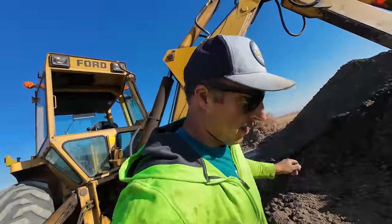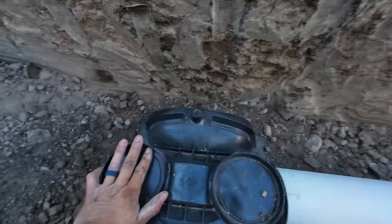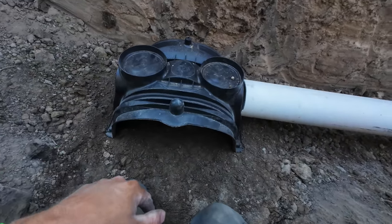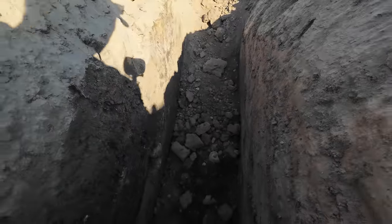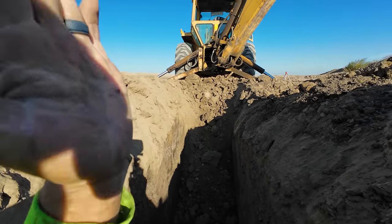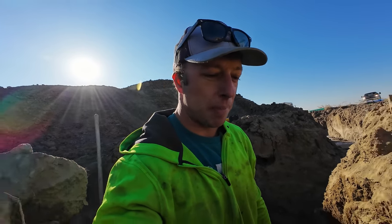Keep getting pulled back and forth between different projects, but I'm back here again. The beginning of the infiltrators is right here. I've got grade set with a slight slope down to this point - from here on it's got to be level. I've got the height set here, I'll use my laser level and run across this whole thing a hundred feet, hopefully perfectly level. I'll be jumping out periodically sticking this down in the trench - beep beep, up, too deep, not deep enough - and then when it's all out, start laying chambers in.